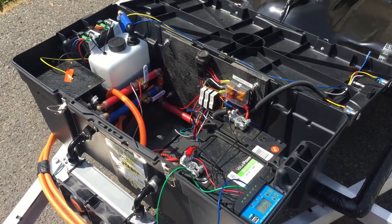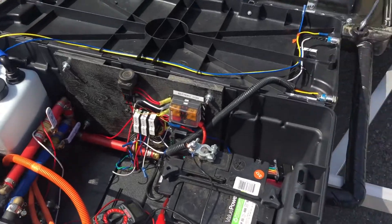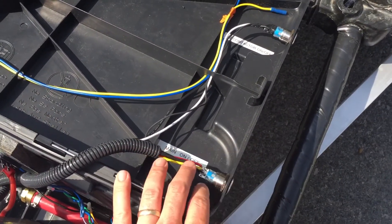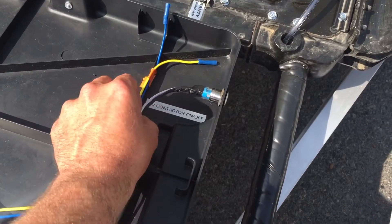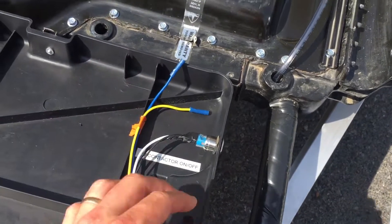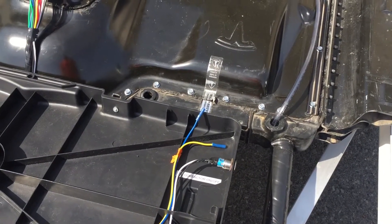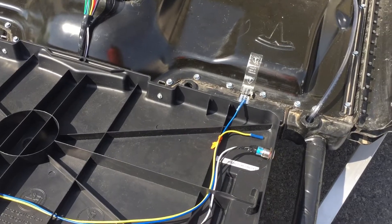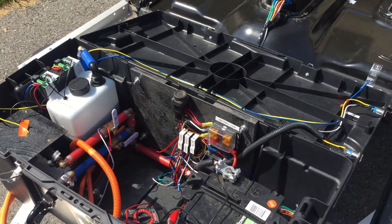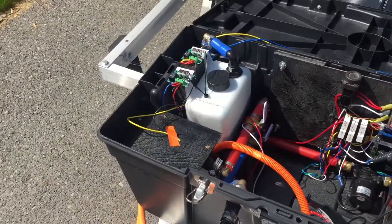It's not pretty — I still have to bundle up the wires and hide everything better. I did get a label maker so I started labeling things. Starting at the switches: the main on/off for the whole system, and the contactor for the high voltage pack on/off. These two wires are going to indicator lights I ordered — one is for cold, one is for hot — so I'll know just by looking at the outside of the box whether the temperature switches are calling for heat or cold.